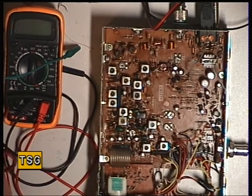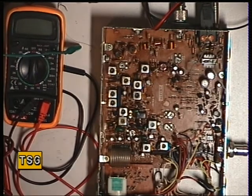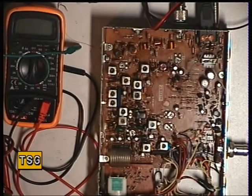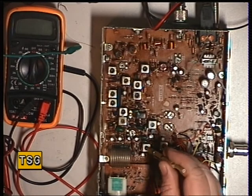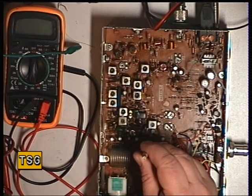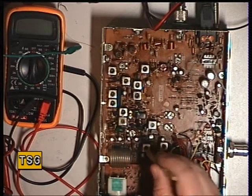We'll move on to the receiver now. As you can hear, it is working — the signal generator is on. I've folded my notes into this service manual somewhere. We'll start with the first receive coil, which is L6. We'll move on to the next one — the second one is L5.